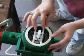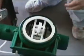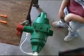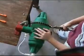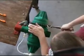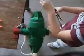Place the cap O-ring onto the groove in the motor body and screw on the top cap, being careful not to knock the O-ring out of the groove and pinching the O-ring. Hand tighten the cap. Finish tightening the cap with a chain strap wrench. Make sure that the assembly fixture is completely into the outlet. It is easy to crack the outlet if the assembly fixture is not all the way in. The ribs on the cap should be generally aligned with the inlet and outlet of the body.